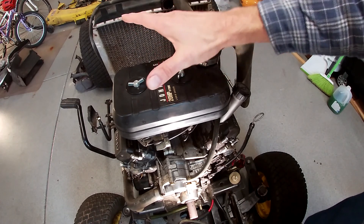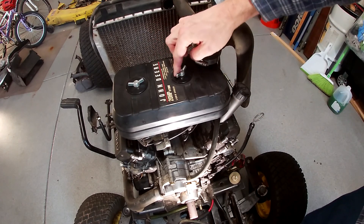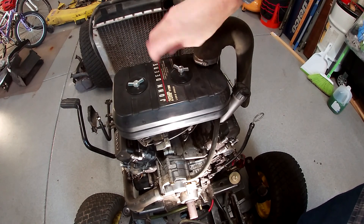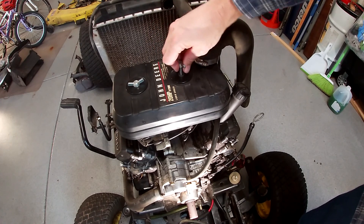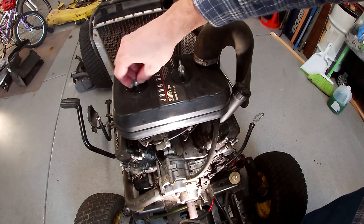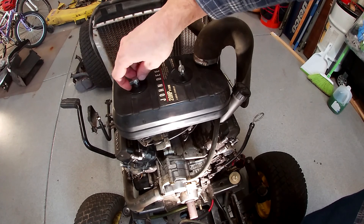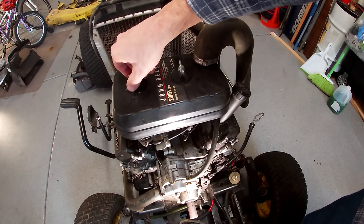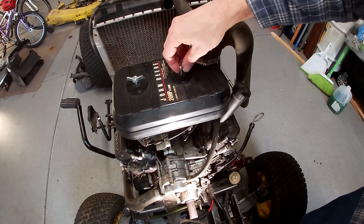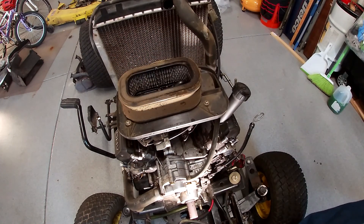Now that all this is out of the way, I'm going to take the air cleaner off and I may or may not remove the carburetor — I'm not exactly sure. I tend to change my mind a lot as I get farther into it, like I did with the radiator. I thought that would come right out, but nope. I could have pulled that radiator out and pulled those fittings apart, but if you've got hydraulic fittings that are not leaking and they're covered with dirt, you want to leave them alone if you can. You crack them open and they'll never be the same. If there's nothing wrong with it, I'm not going to mess with it.